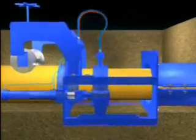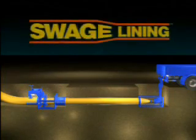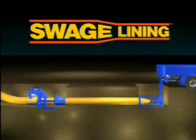Lengths of butt-fused pipe are pulled through a reduction die and into the host main using a winch. This creates the necessary insertion clearance. On release of the winch load, the pipe recovers naturally, creating a tight fit. Pipe lengths of up to 3,000 feet or 1 kilometer have been installed in one pull.